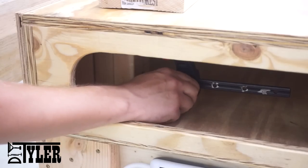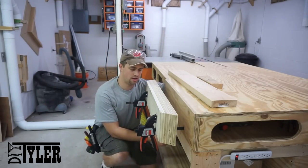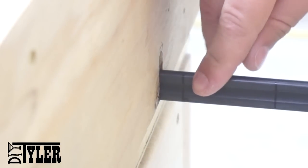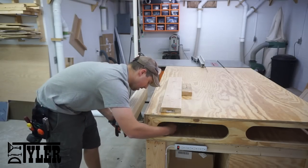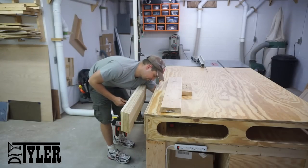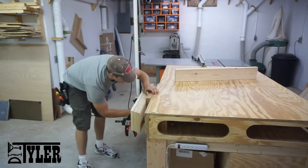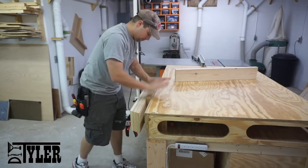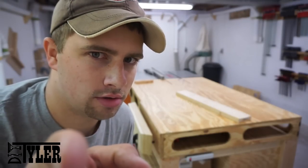Reach in the back and adjust these knobs to the open position. The knob on this side is a bit of a pain but having done it a few times now it gets easier each time. So let's adjust the vise in to clamp that 2x4 width-wise. I'm going to adjust in until one of these lines is right outside the backboard of the vise, then index the back up and tighten that down.